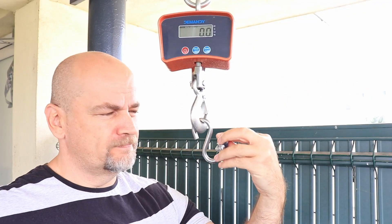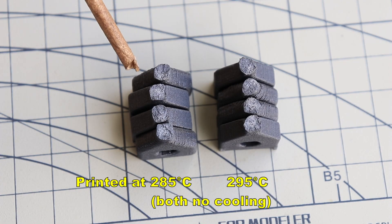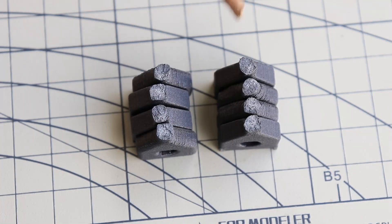This one is strong too. The only difference between these objects is that this one is printed at 285 degrees Celsius and this one at 295 degrees Celsius, and I can see these cross sections are a little bit more rounded compared to these ones. Theoretically they should be squared, so definitely 295 is very high temperature for printing this kind of overhang or small surfaces without any part cooling.